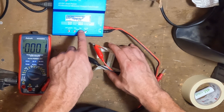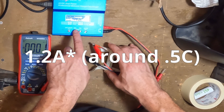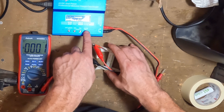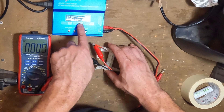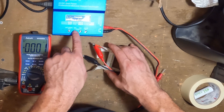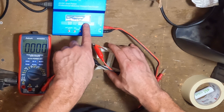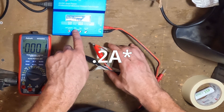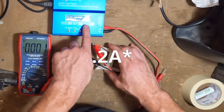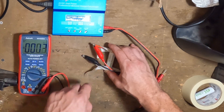We're going to do a lithium-ion cell and charge it at 1.2 volts, but there's an error when you try to charge it with lithium-ion. The reason for that error is that it's too low voltage to actually charge. So if we go to a NiMH charge, we can actually charge it with a very low charge — we're going to use 0.2 amps — and as you can see, it's actually going to charge.